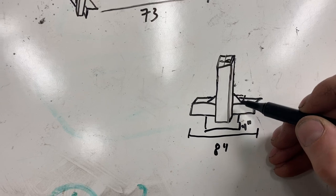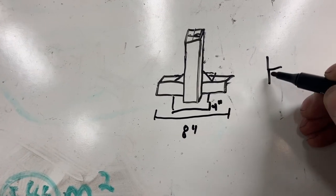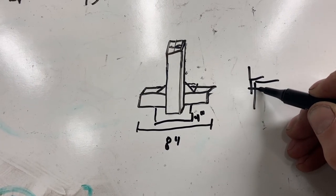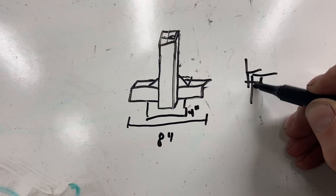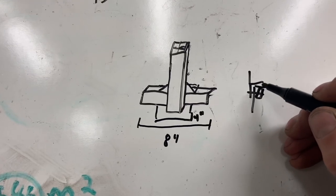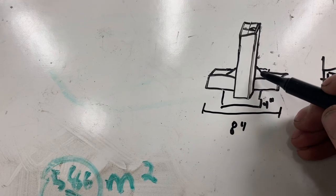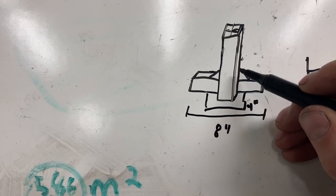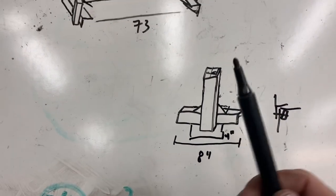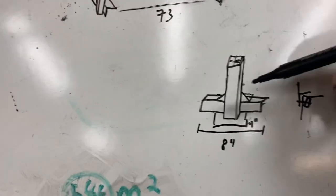And I'm going to stand them on top of each other. So the side profile will look like this. And this will overhang the trailer roof and get screwed into the rail of the trailer. At the top, there's a square tube, so I'll sink a sheet metal screw, two per bracket in there. And then the top of this one will be drafted at 45 degrees just to add stability. Give you 3 full inches of support along the side so that if there's heavy things up there, if it starts to get rocking, it's not going to want to crack or bend over.